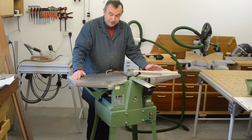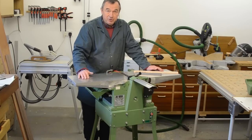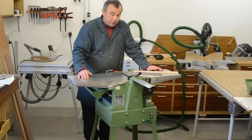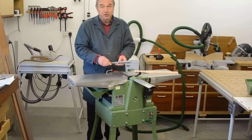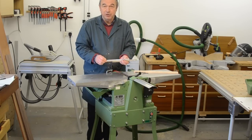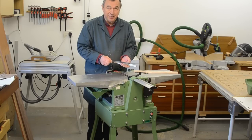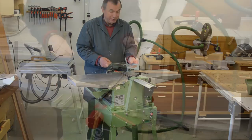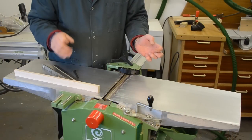I've been looking after mine very carefully and that's really why it's lasted so long. One of the jobs I'm doing today is to reset the blade height. I've got tungsten carbide blades — I've recently had them sharpened, so now is the time to set them up again. I'm going to show you how to do that. I've brought you in a little closer and I've turned the machine around so you can see things more clearly.